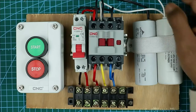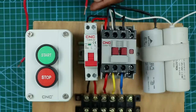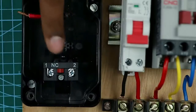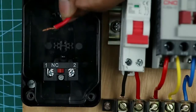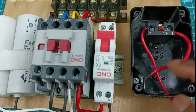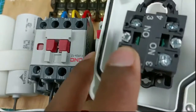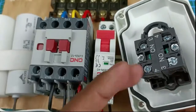The input wire of this starting capacitor is to be connected in the control wiring. In the MCB at the phase supply output terminal, connect a wire. Take the other end of this wire to the stop push button element. This is the element of the stop push button, so connect this wire here. At the output terminal of this same contact, connect another wire. Take the other end of that wire to the start push button — at the back side of the start push button you have to use two NO contacts.